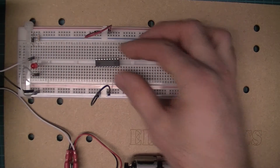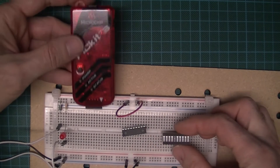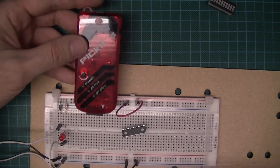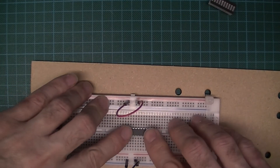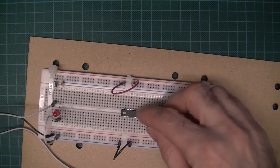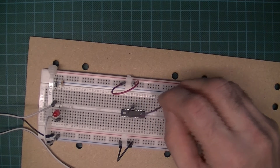Now we need to place the PIC chip and the PICkit somewhere on the board, leaving room for an LED array or other components. Give it some thought as to where things will go - don't leave too little room for the PICkit, that's the most common problem. I'm going to place the PIC 16F88 in the middle. These 88s are better than the old 16F84As because they have an internal clock, making the circuit simpler.